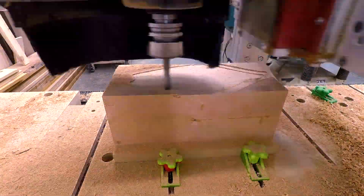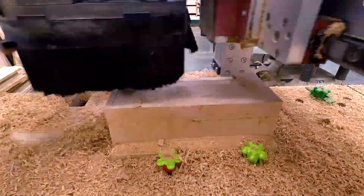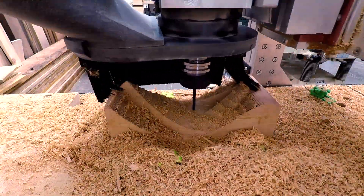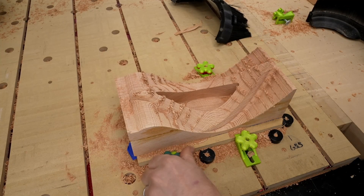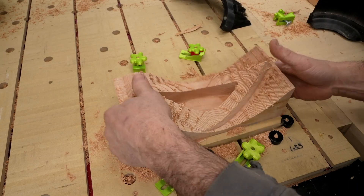What I settled on was using a pocket clearing toolpath just for the little top bit to avoid chip-out, then going into a 3D adaptive toolpath which can remove a lot of material really quickly. I could then come in with a quarter-inch bit and machine out the middle area. I left the piece rough — I didn't do any finishing toolpaths except in that middle area, and I'll show you why in just a second.